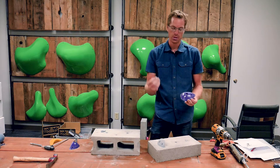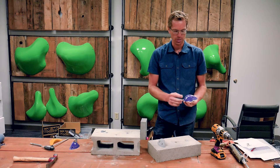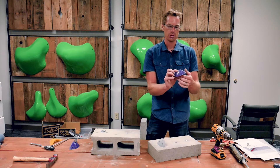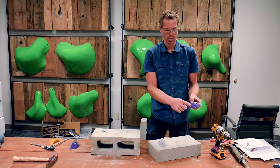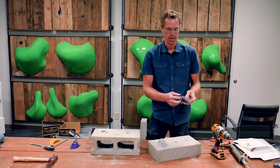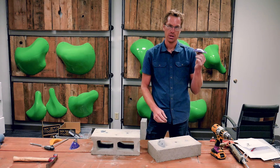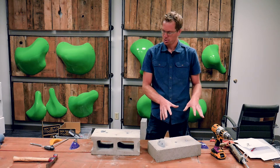Something I mentioned earlier is you can use our lone stars. If you have a bolt-on hold, you can convert it to a screw-on. This is one of the legacy holds — with the lone star, it makes that bolt hole able to take a nice long concrete screw. Two screws is not enough to hold it, so I'd go ahead and drill another hole here and here, giving you maybe four concrete screws holding it down, a lot of surface area on the back for the concrete adhesive to bond, and then you'll have a hold pretty permanently on whatever wall it is.